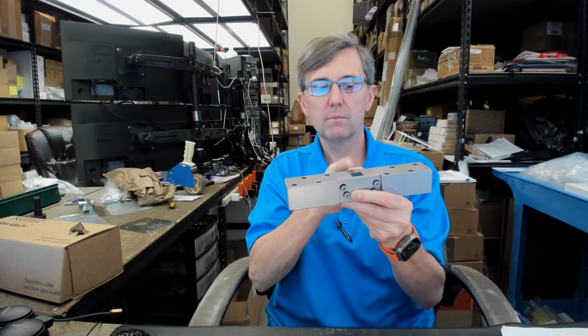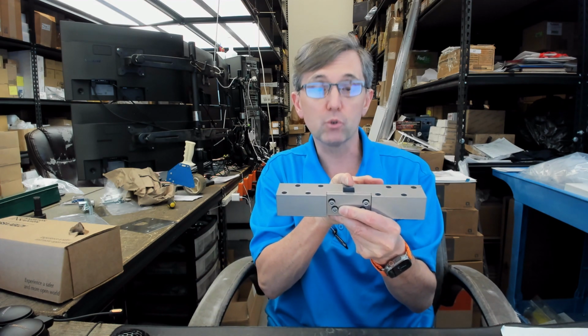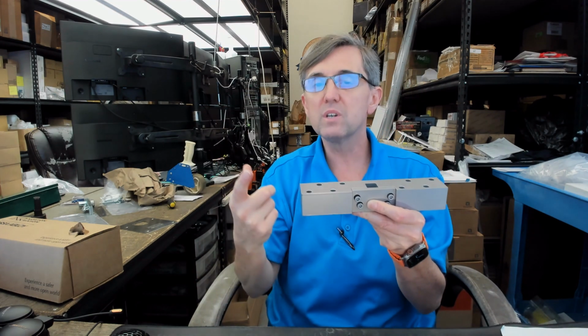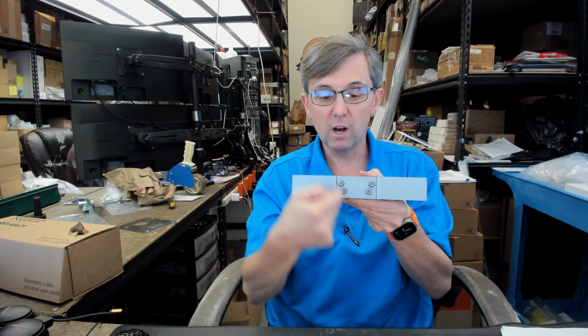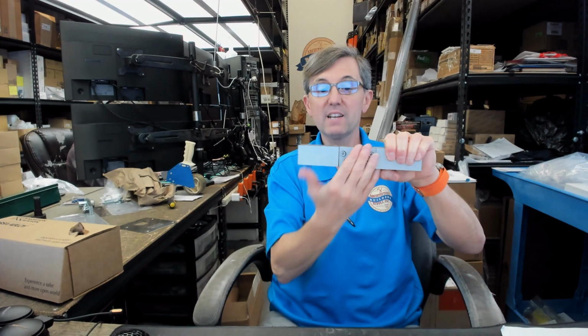Because your pivot point, I mean, that's 9-inch. Let's say that that's in the center at 4.5. I didn't measure it, but it probably is. Imagine hogging all of that out of your door. Well, you wouldn't do that. What you would do, though, is notch the face of the door just big enough so this plate can come off, so that when you get the door in position, you can get this connected to the bottom spindle, and then you just tip it up in place.